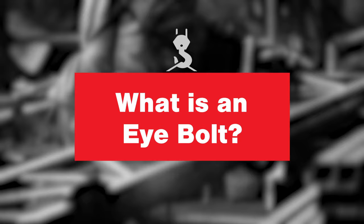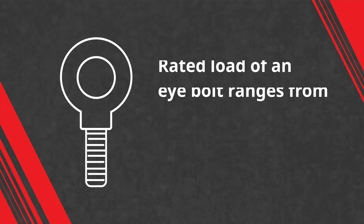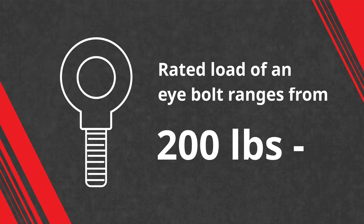So what is an eye bolt? Used as a lifting or securement point, eye bolts are one of the most popular types of rigging hardware. Just like slings, sling hooks, and shackles, eye bolts come in a number of designs and different configurations. Eye bolts can be used as a connection point for rigging, anchoring, pulling, or hoisting applications. Eye bolts are stationary lifting points, and only certain types can accommodate angular lifts by factoring in a significant reduction to the working load limit, or WLL. The rated load of an eye bolt ranges anywhere from 200 pounds to 65,000 pounds. Depending on the size and shape of the load, lifts may be performed with the assistance of one or multiple eye bolts placed throughout the surface of the load.